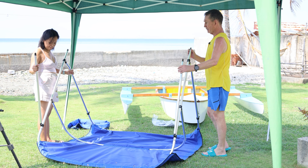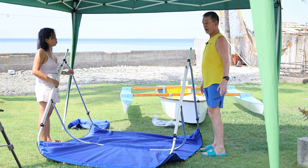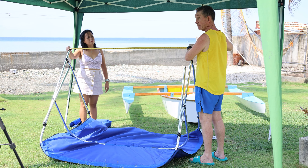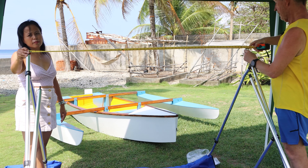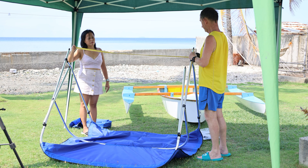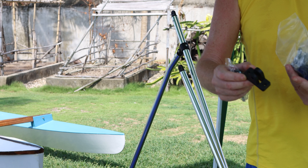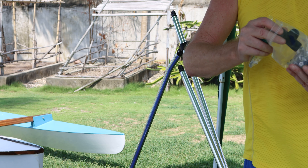The next job is to measure the distance and put the bolts on the boat. So I'm going to measure the part that sticks out — the outside of that to the inside of that, which will be exactly the same as the centre. It's saying 62 inches, or 1575 millimetres. So 62 inches is the number we are going to use. We have four pieces like this to fit — a bolt goes in there and a thumbscrew on the outside, and it comes with wood screws.